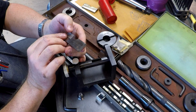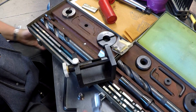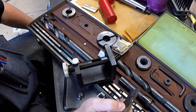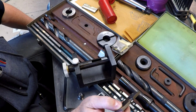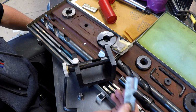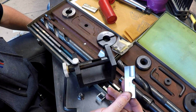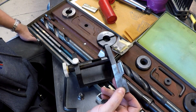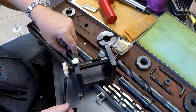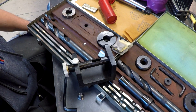But so you can do custom sizes. It's really easy. You're not going to do a custom size annular cutter. You can do a custom size drill bit by grinding down the point and the flutes of a drill bit, but this is for a lower volume application. This is the way to go. Now this is the Series E set. Both of these start with a 1-inch pilot.